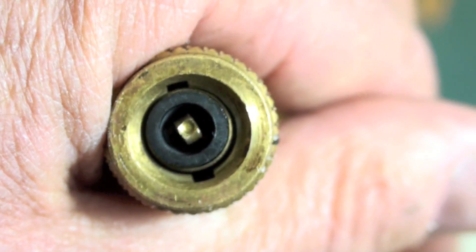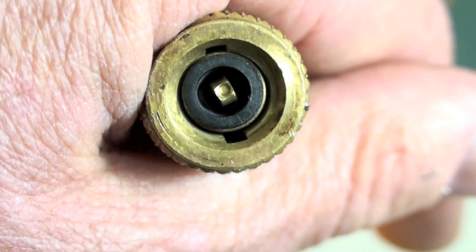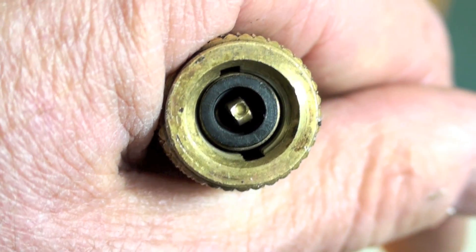I've had a number of people who did not know the gasket was missing and went ahead and tightened it down. They got a small leak, couldn't figure out why they had a small leak, kept tightening it down, and eventually ruined the hose.